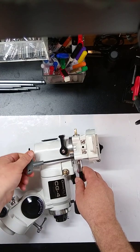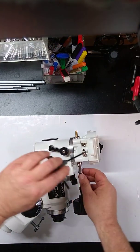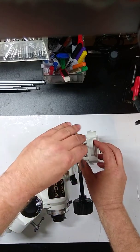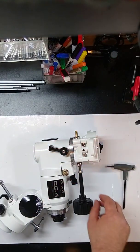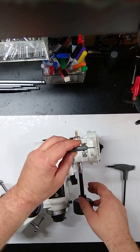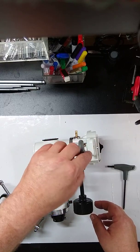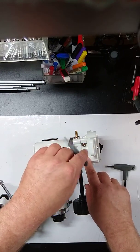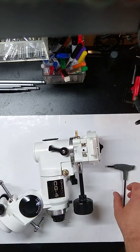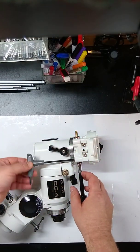This is an iterative process. Go ahead and loosen these side ones maybe half a turn, and these top ones about a turn. Now we need to pull the worm up, so we tighten the central screw. Since we don't know how far loose it is, let's just take it until we feel some tension. You can even put your finger on the housing and feel it starting to move. So if I start there, let's make these outer screws just barely snug.